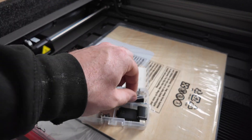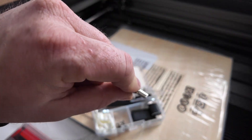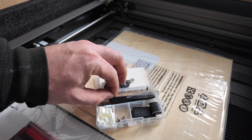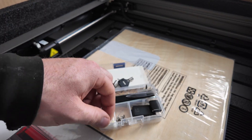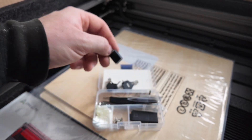We'll have a look through the instructions and see what's what. It also comes with a little cable tie. Until we get into the instructions we won't know what any of this is, but it's nice to look at. Now we've got a little box of tricks - we've got a little set of tweezers, we've got the key which is another safety feature. You've got to have the key in and in the on position for it to work. We've got some straps for the cables or the air assist, a little wipe to clean the lens, a USB-C to A adapter, a USB card reader. Basically you can cut without it being plugged into a PC - you load files onto the micro SD card, plug it in, press go and it will cut.